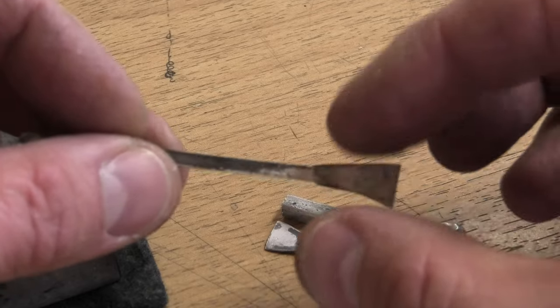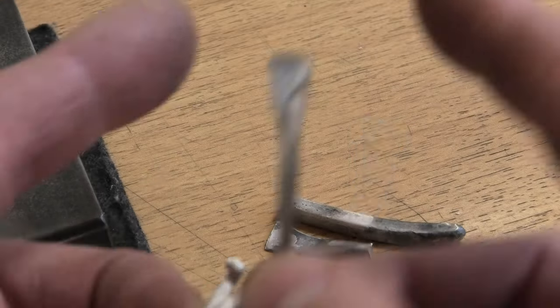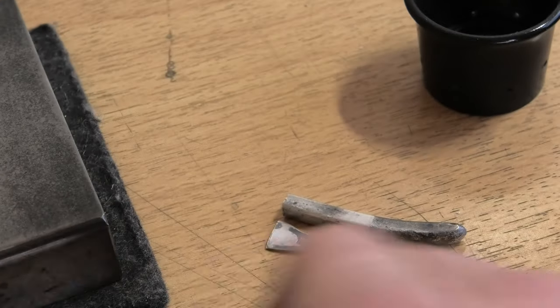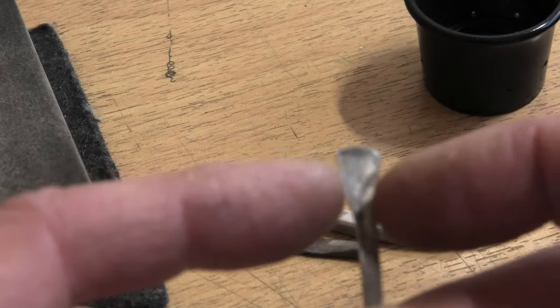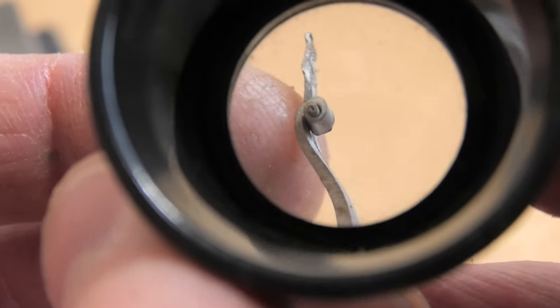Basically you mill it out flat toward the end, then mill it wider, then roll it back so you get this kind of effect — a nice little design feature that might be useful to some people. You don't have to do it that way. These are spread out; you can spread it in, but then when you roll it up that little scrolly bit goes deep inside, which might be preferable. Or it goes slightly tapered, or even straight — you might just want to create that shape and hollow it out and put a diamond in there.